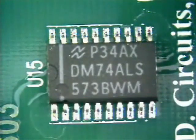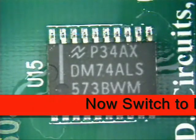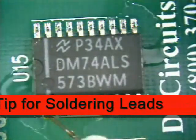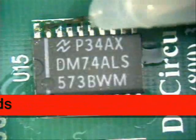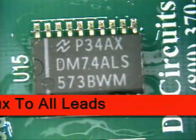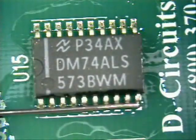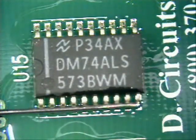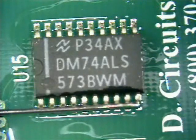Next, switch your tips out from that bent conical tip to the large hoof tip that I showed you earlier. Apply flux to all pad, foot, and pad areas. Next, lay the solder on top of the foot, just like that, over the entire foot area. Clean off your tip, thermally shocking it, making sure you get all impurities off of it.